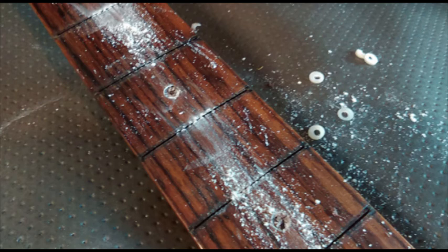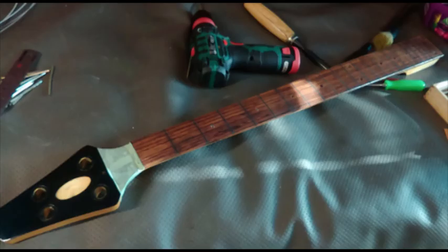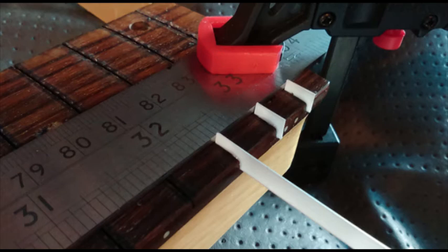The fingerboard is reported as being a rosewood, fairly low end rosewood. Some staining I think had been done to this one, that was the impression that I had. And a very quick rub down was done just to very basically straighten it with a bit of truss rod adjustment so that it was dead straight under a straight edge. And this allowed me to get the process started to fit the fret position markers, or the position markers should we call them, which I like.